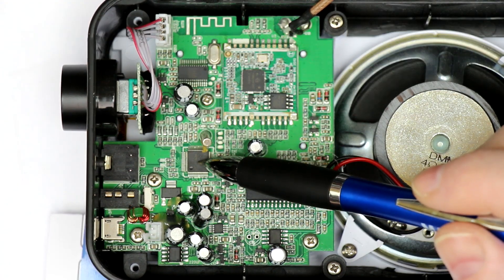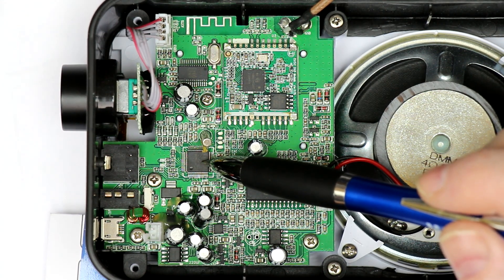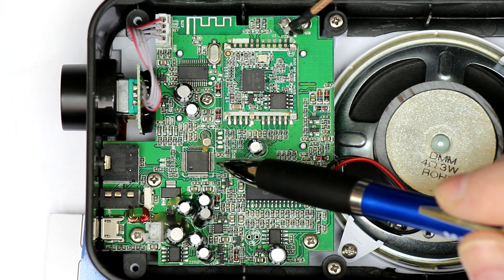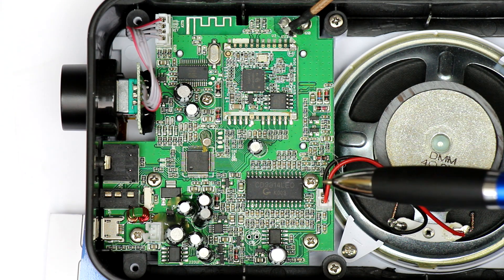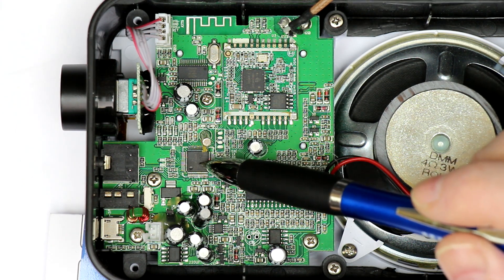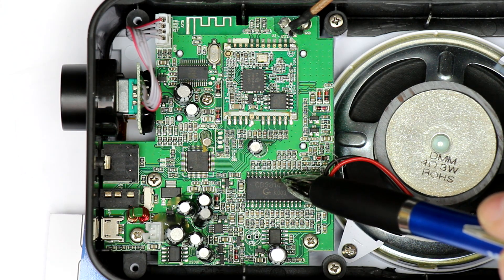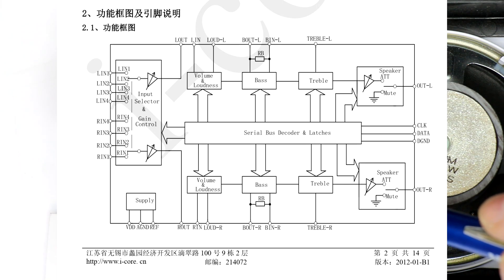This is the central controller. I couldn't fully identify this chip — I could only read that the manufacturer seems to be a company called DXChip, and the part number appeared to be AT12C, but I didn't find anything in the datasheet archives. Next is a chip called CD3314, which is a four-channel stereo sound processor, probably just for modifying bass and treble, so it does nothing critical.